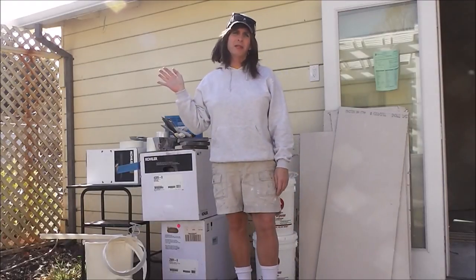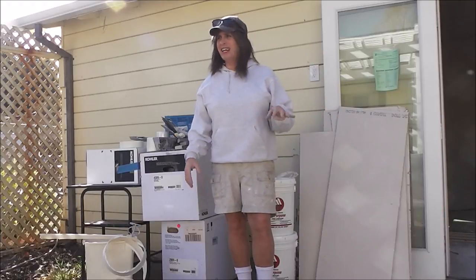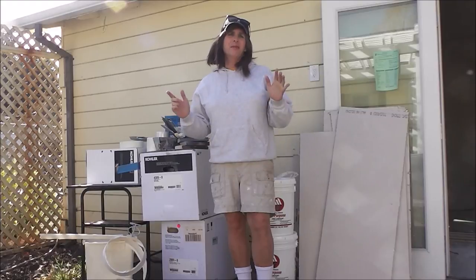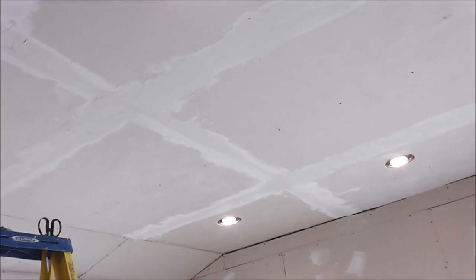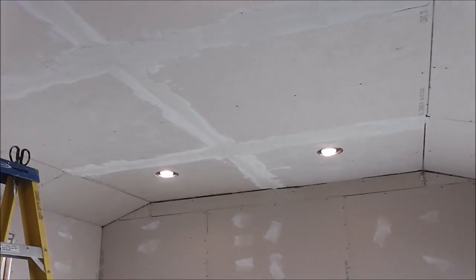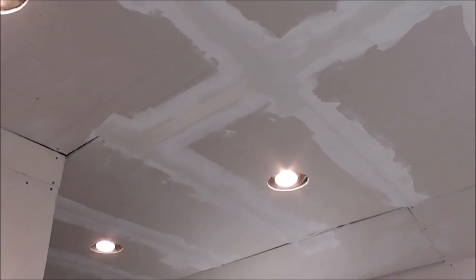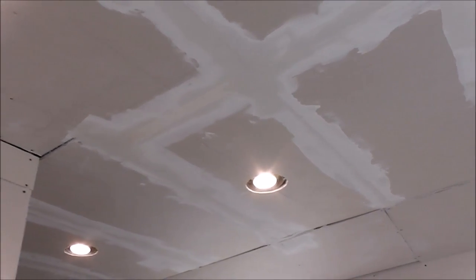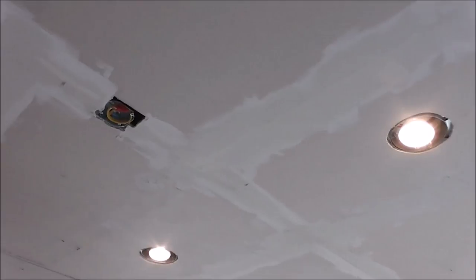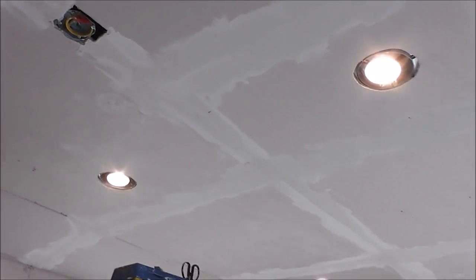So these are the tools of the trade we're going to be using tomorrow. I'm going to go in this afternoon — Rosie on the job — I've got two more panels to get down in there, and I want to have everything all set for tomorrow. I was just going to do a little show and tell with the tools of the trade, but I got carried away. I went and got the ceiling up there with at least an initial coat on it. You can see the smallest width trowel working it, and you can see the importance of why you needed to get everything really level on the ceiling — it's going to look perfectly level when it's all feathered out. The next coat will be the medium width, and then we'll finish with the wide trowel.